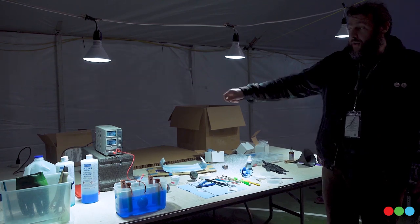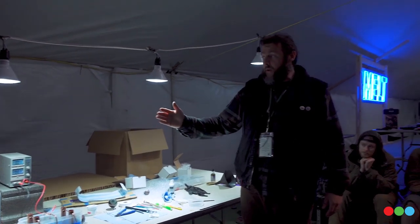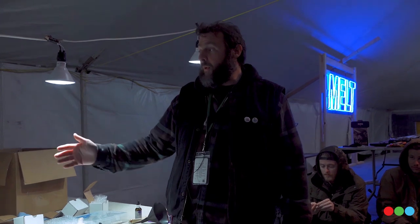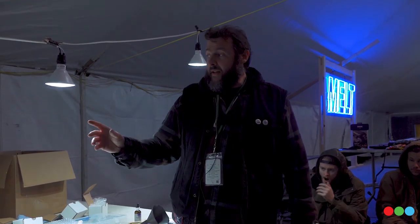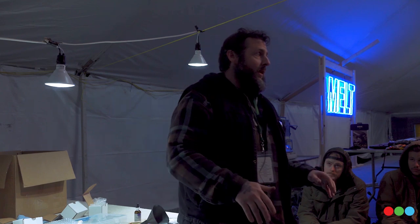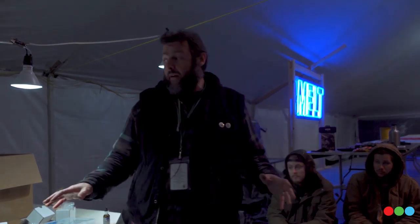You know, for newer solution, I'm going to wait for it to bounce from 0.1 down to zero, then I'm gonna turn it up. And I'm gonna keep doing that as it accumulates. As the copper gets thicker and I'm more aggressive, if it stays on 0.1, my next indicator is never, ever, ever let it get up to 0.2. 0.2 is always too aggressive. That's what I have learned.